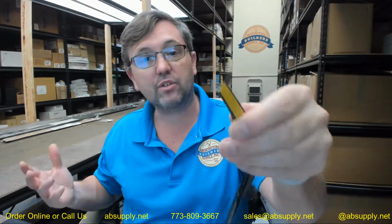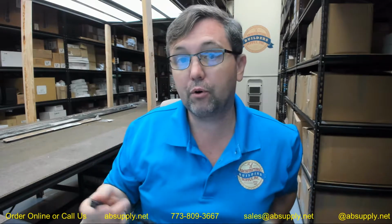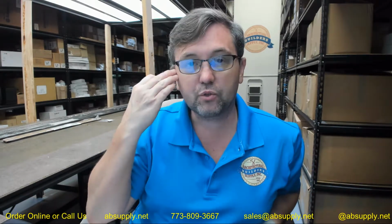Now let's get into the balance of the information in the extended description. This is a silicone type material in a dark brown or dark bronze type color. The seal begins compressing at 3/8 of an inch and will compress down to 1/16, meaning in its natural state, it's going to be allowing you to close up a gap that's quite large, 3/8 of an inch. Well, that would actually be far larger than a typical fire-rated opening would permit, because depending on the door construction, wood, it'd be 1/8 of an inch margin, max.